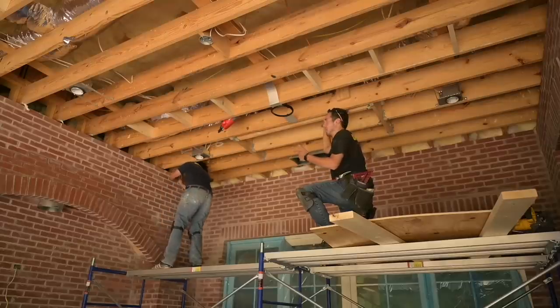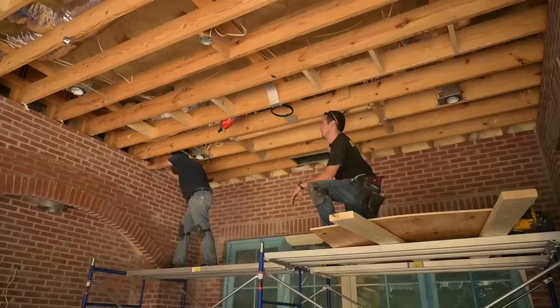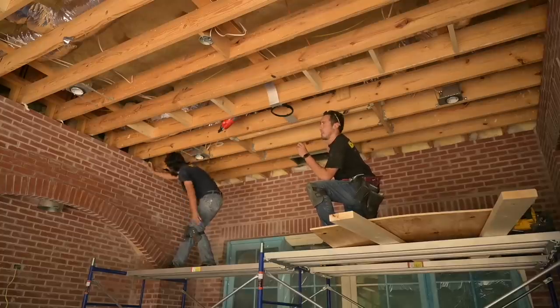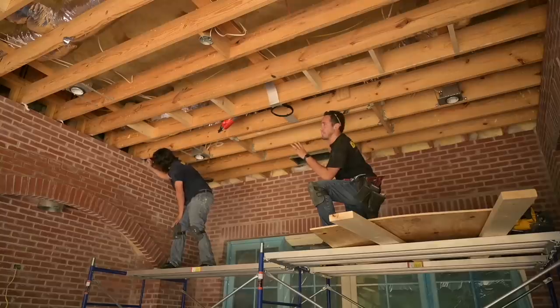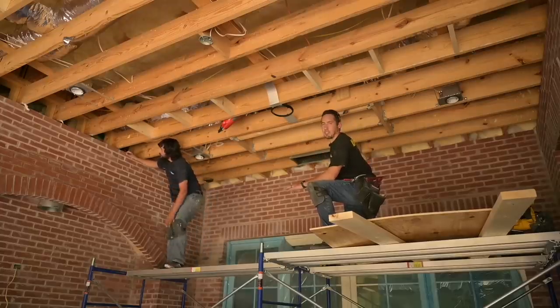What we're doing right now is marking the joists with a pencil on the brick — the brick's going to be washed and painted anyway. That way we can connect those lines with a chalk line and snap them, so when we go to do our coffered ceiling we can see everything and know exactly where to install it.